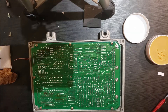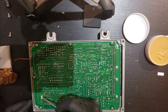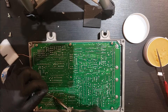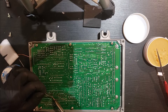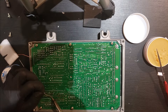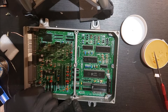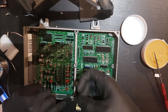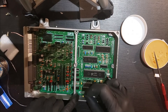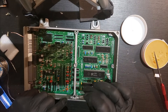Now it's time to solder that in. The last thing to do is install the data logger port — it goes to CN2. From where it says CN2, it is the four prongs from left to right. If the harness is on this side, it's positions one, two, three, four. That's where you put this connector. I'm going to desolder that location and then install the data logger port.